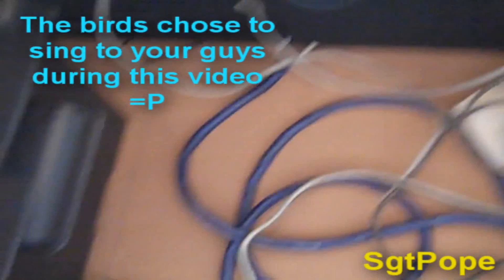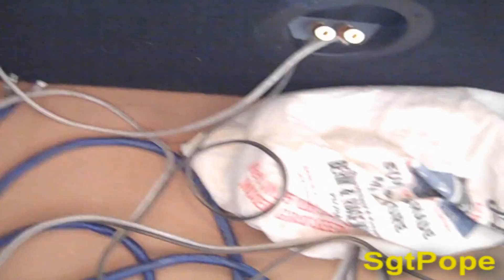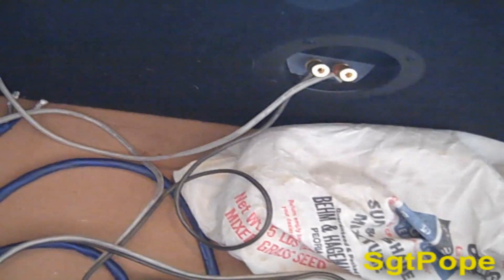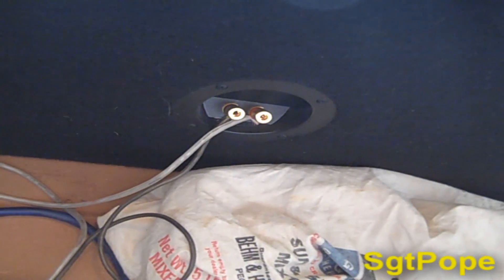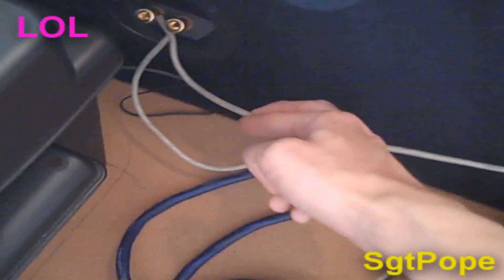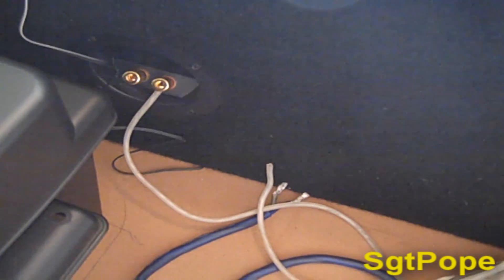Now that I have it set up, that speaker wire coming straight from the amp — you put the positive on one side on the left, and then negative on the right. It doesn't really matter which side you put the negative or the positive on. Then just one single speaker wire, you bridge the gap on the two open ones. In my case, positive on the right going to the negative on the left. I cut this one a little bit short so I didn't really hook it up, but you still get the idea.